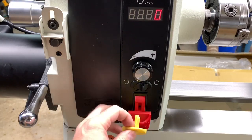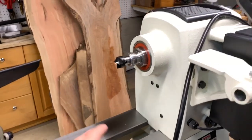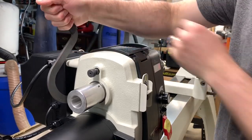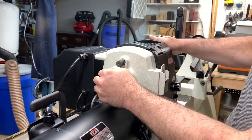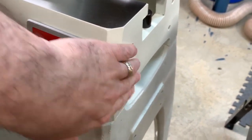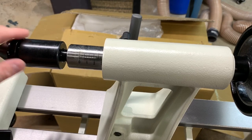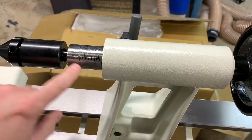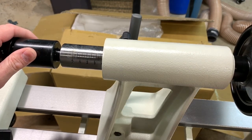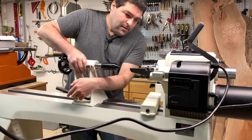It has a nice paddle switch with a safety feature for kids, and a rubber tool mat up top. It does have a 16 and a half inch swing over the bed, 12 and three quarters over the banjo, and 40 inches between centers. I do have a bed extension coming which will give me 60 inches between centers and an additional 18 inches for outboard turning, totaling approximately 34 and a half inches in diameter. The tailstock, like the rest of the lathe, is cast iron. It has an anti-rotation locking wedge, a 4 and a quarter inch quill travel which is smooth moving, and the tailstock is solid and locks down solid.